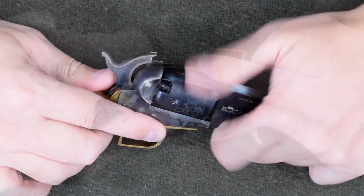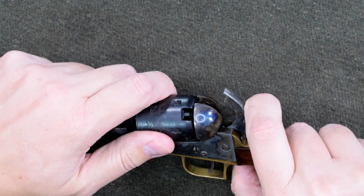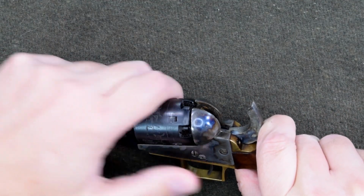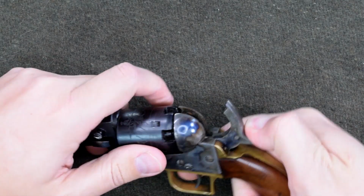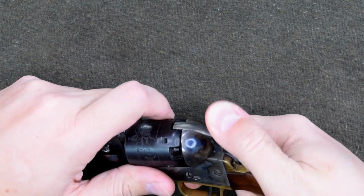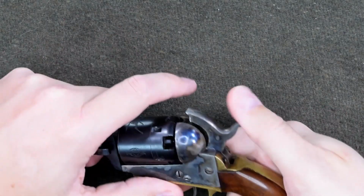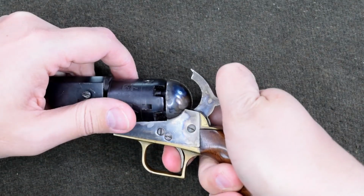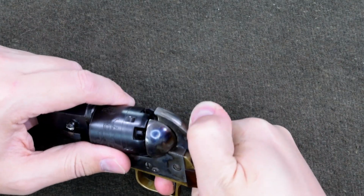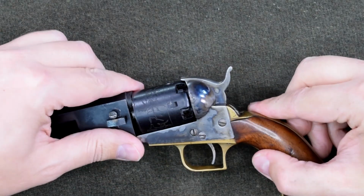I need to guide that over to the correct position on the other side, and then I have to cock the hammer back, and oops, I over-traveled. Well, let's try that again. I'd have to... oh boy. Go to the half-cock position, roll this guy down with the safety nipple 2 positions away, cock that to full cock, start lowering the hammer, then index this guy over. I'm sorry if that's a little hard to see, but we end up setting the hammer on the safety pin